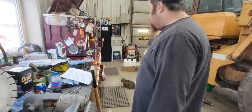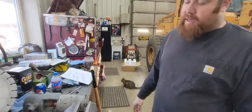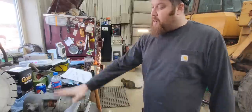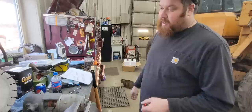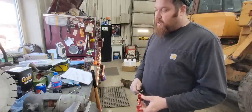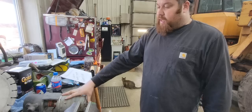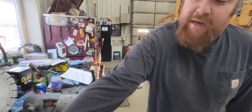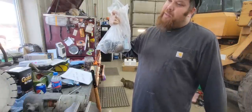Got that ready to go. Jump on this loader — it's going to be a busy weekend. I've got a lot of things I want to get done. The loader is top priority because we've got to use it next week. I've got a primer pump off of a fire truck that I need to build a carrying roll cage out of some one-inch tubing to mount it with a little oil tank. We use these for priming our irrigation wells — they suck the water up the well casing until the Berkeley pump can grab it.